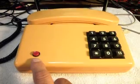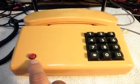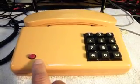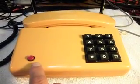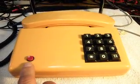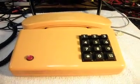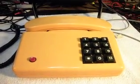We replaced the momentary switch that was factory with this one. The factory one was just a momentary, you just pushed it and threw a signal. But this one is more like a light switch type switch. You push it in to turn it off, and you push it again to turn it back on. So that's our off and on switch now for our bell.